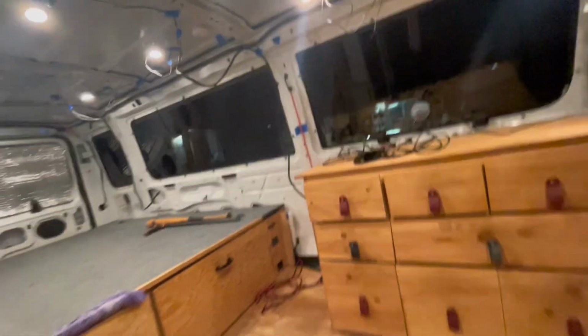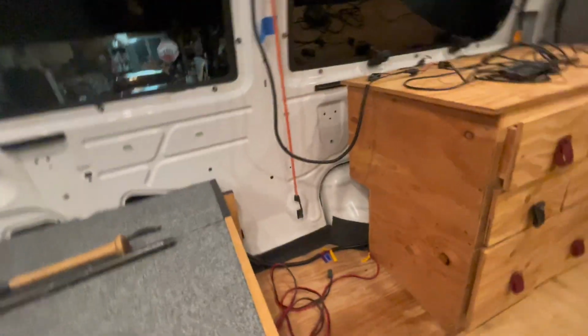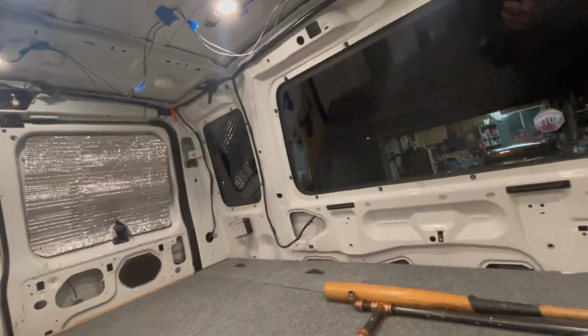So I went to Home Depot. I found some shiplap, which I think I'm gonna use. But I need to make the studs, so I'm gonna grab some tape and tape where I want to put the studs in their location. That way, when I get the shiplap, it'll be ready. Just put up the studs, put up the insulation, use some string to hold the insulation in place. And yeah, I'm ready for the next step.